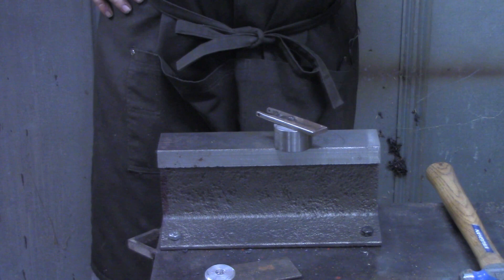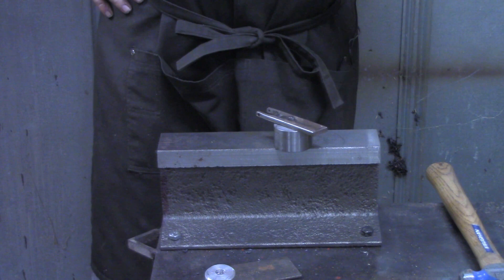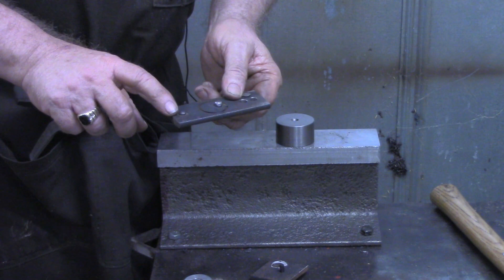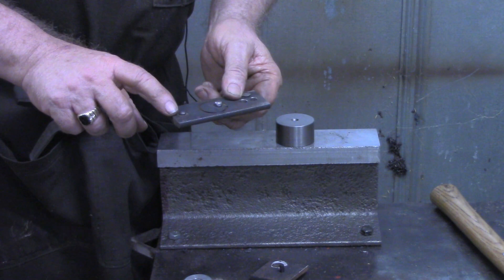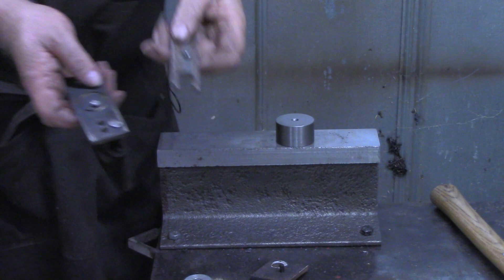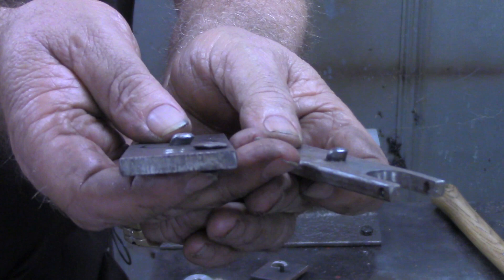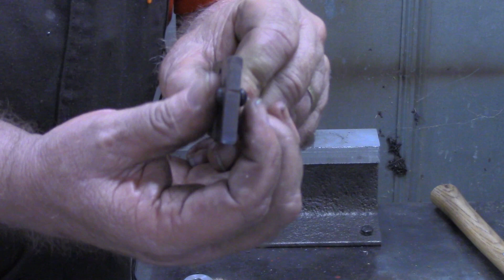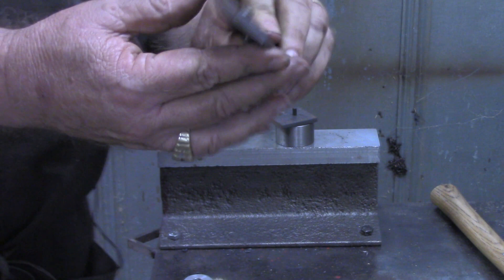I'm going to call this one a failure too. Let's go back to the workbench and recap. Before I entirely give up on this project I'm going to try one more thing. Back originally, this cold set did a whole lot better than either of the two hot sets. Both times I'm guessing the rivet was soft when I hit it and didn't hit it directly in the center — it leaned over both times. They're way off to the side, way off center. The problem I had with the cold on the first one was that it just didn't seat tight — don't know whether it slipped down a little bit before it set or exactly what happened, but got a good head and a good set on it.